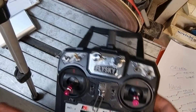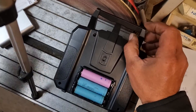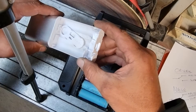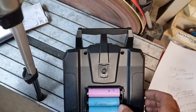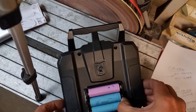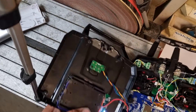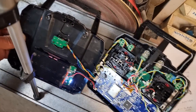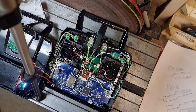What does that look like inside? I've also converted mine to lithium batteries using one of these cheap AliExpress battery packs. I use the module from inside those to convert the voltage — I left the LEDs on which is why mine is still there. That little module converts it over to 5 volts from 4.2 or 3.7 volts depending on how charged your batteries are.